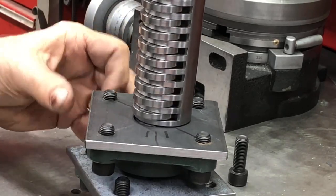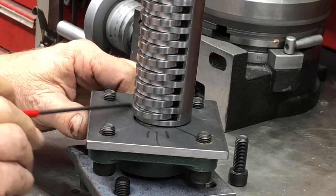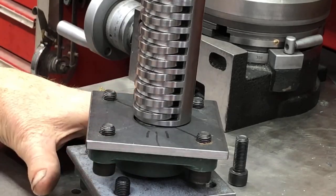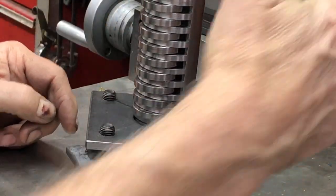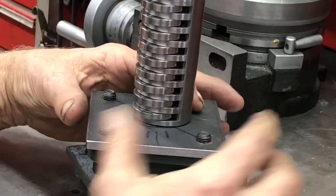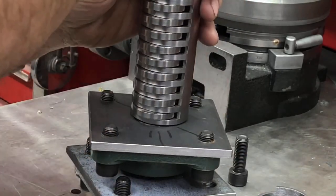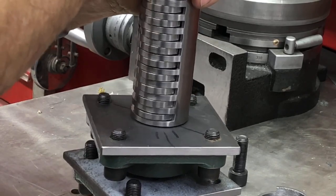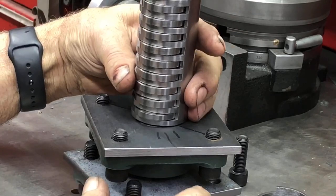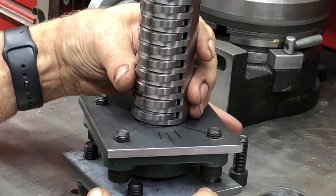And when I'm there, these openings line up from straight across. But right there, there's a big gap. So imagine it pivots here, and I have a bracket on the other side that can move it back and forth. And I want to adjust the depth of cut. All I've got to do is rotate. I got to get the load off because it's loose. Just rotate this guy out to whatever depth I want. Could be 2 millimeters, 3 millimeters, 4 millimeters, just like that.